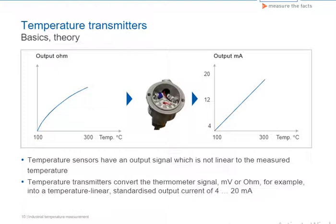Advanced transmitters can compensate for these errors through the linearization of the thermometer signal using a standardized characteristic curve. Within a certain temperature range, a two-point adjustment can be carried out by setting up zero and span to further improve linearity and accuracy. The highest accuracy over the whole temperature range can be achieved by an individual correction curve that can be stored in most programmable transmitters.